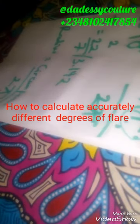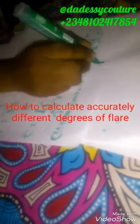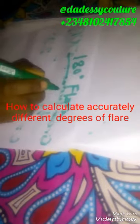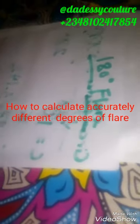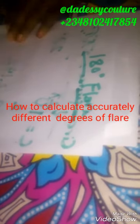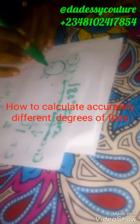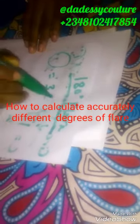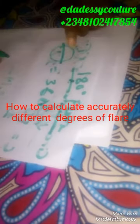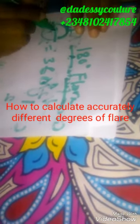So now let us move to how to cut. I told you I'll be teaching you how to cut a 180 degree flare. Please just follow me strictly. Mathematics is interesting, you just have to know it. So I'll be teaching you to cut a 180 degree flare, and also how to cut a 360 degree flare today. We all know that for a circle, the number of degrees round is 360. It's 360 degrees, and what we want to cut is 180 degrees. That means it is half of a circle that we want. 180 plus 180 is going to give you 360. That means it is a half circle flare.